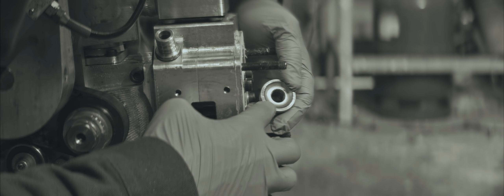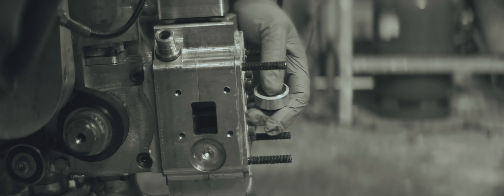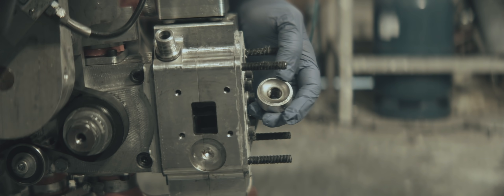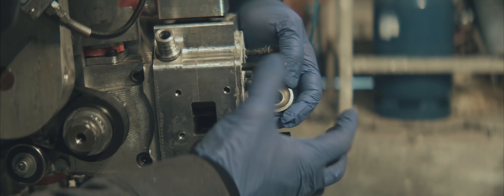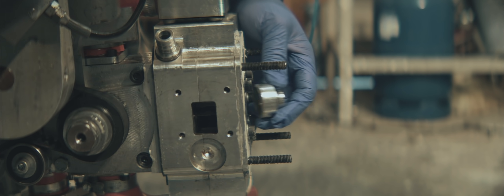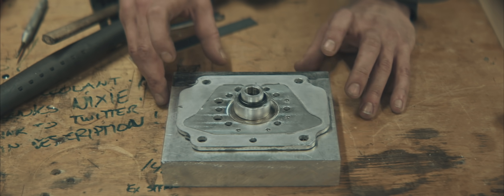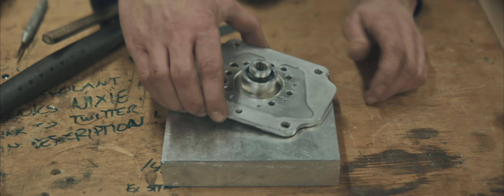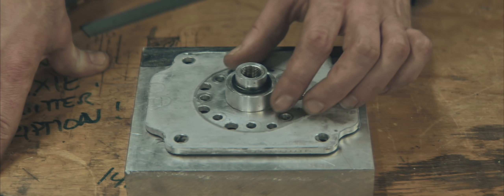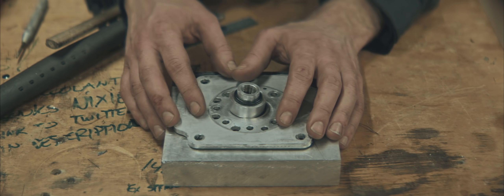You can see that my design is kind of flawed — there's not much material holding this piece on there. I need to redesign it and make it stronger. This is at like 0.4 bar and we want to run much more than that. Actually a good thing — much easier to fix this than to split the whole cylinder and press in the liner again. I can easily redesign this to be much stronger and I've got the material. Good thing we didn't make that clutch dummy ring, because this is my last piece of suitable material. Perfect size for a new one — beefing up this area, sacrificing cooling for a part that actually holds together.